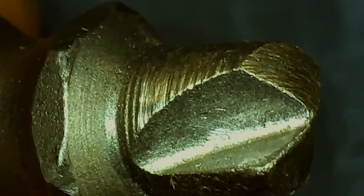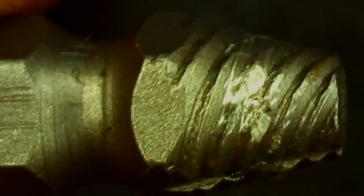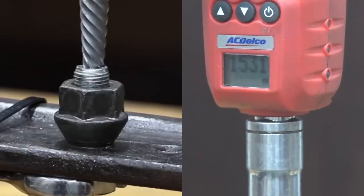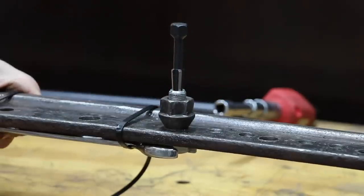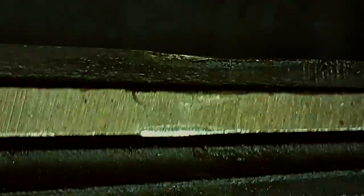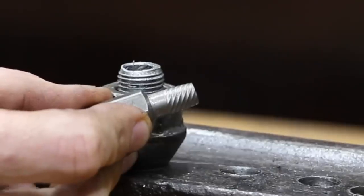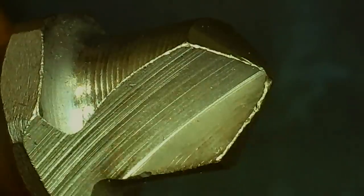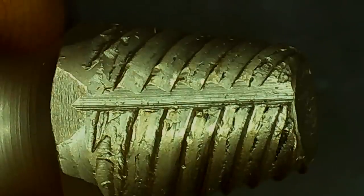The Speed-Out took around 45 seconds to drill the bolt and the drill was pretty much used up after one use. The Speed-Out did a good job at 769 inch-pounds but there was quite a bit of wear on the extractor. The Bosch did the best yet at 1,531 inch-pounds, with very minor wear on the flutes. The Rennstieg lost grip at 452 inch-pounds with quite a bit of wear. The Irwin Multi-Spline delivered 954 inch-pounds and held up very well without any visible damage. The Grab-It Pro achieved 632 inch-pounds and held up very well without any visible wear.